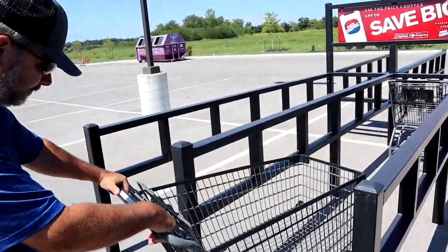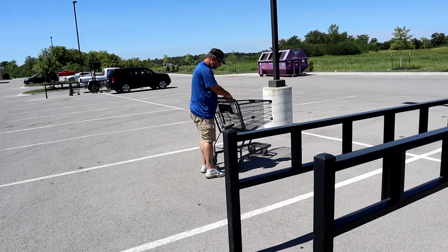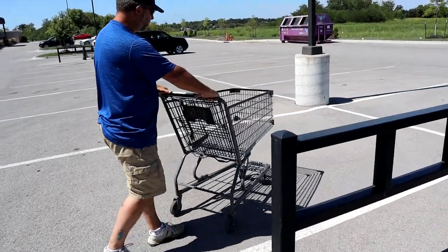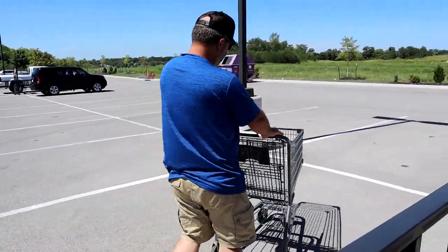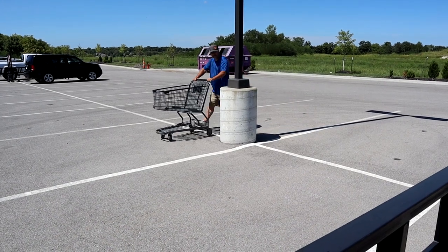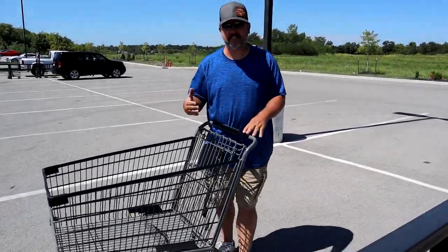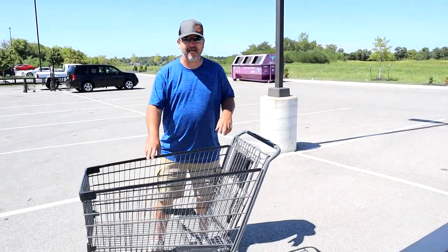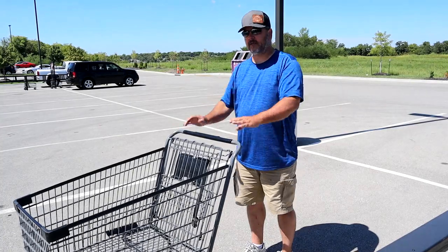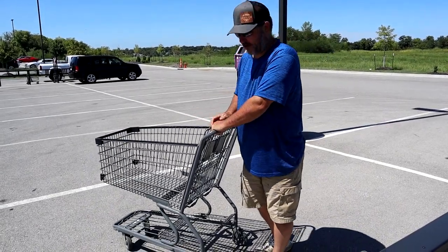So it may be a little more simple than what you think. Driving a zero-turn mower is exactly like pushing a shopping cart around — there is no difference whatsoever. It's all about pushing and pulling, just as you would on a shopping cart. All of the other physics of a shopping cart go along with a zero-turn mower as well. You have the front casters on the front end, so the front end wants to fall downhill all the time, and you've got to be on your game pushing uphill when you're riding your zero-turn mower.